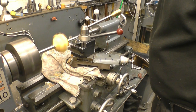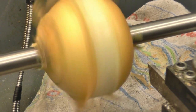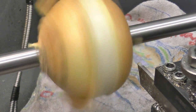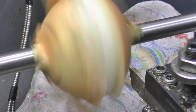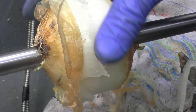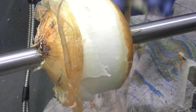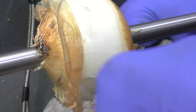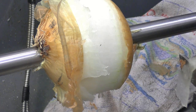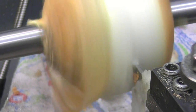That's definitely cutting better. Try a nice deep cut here — try a 60 thousandths cut. That's making some real fine chippings. It's putting a decent finish on as well. I'm getting some lovely fine pieces here, just what I'm looking for. I'm going to try a plunge cut on it because this could also be good for making onion rings. Try going straight in — oh, that really is making nice juicy chips.